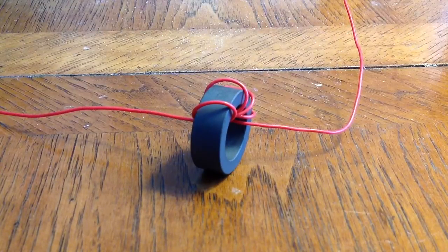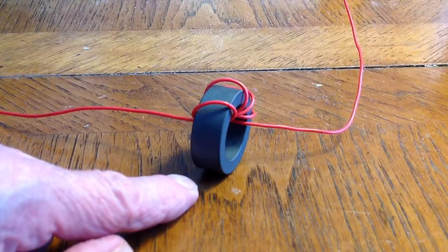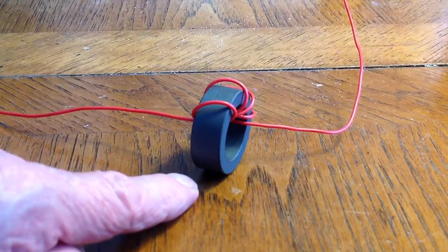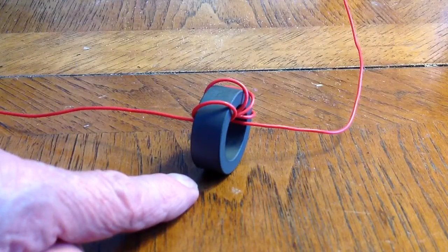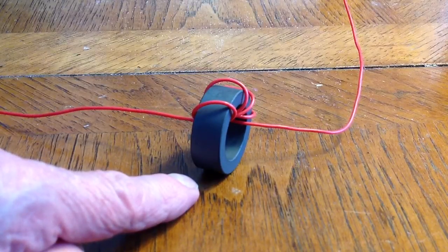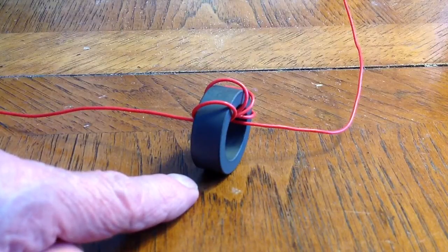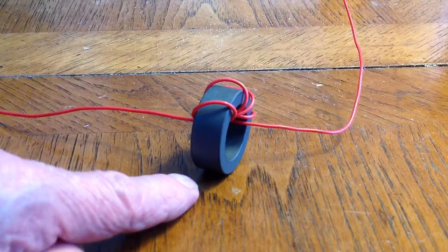This toroid is approximately 1.4 inches in outside diameter — you can get an idea from my finger right there, it's kind of a fat finger. But that's the technique, and you don't really need to keep that thing away from metal objects or anything like that, because the magnetic flux is contained entirely within the core and will not stray outside and cause mutual inductance with nearby objects.